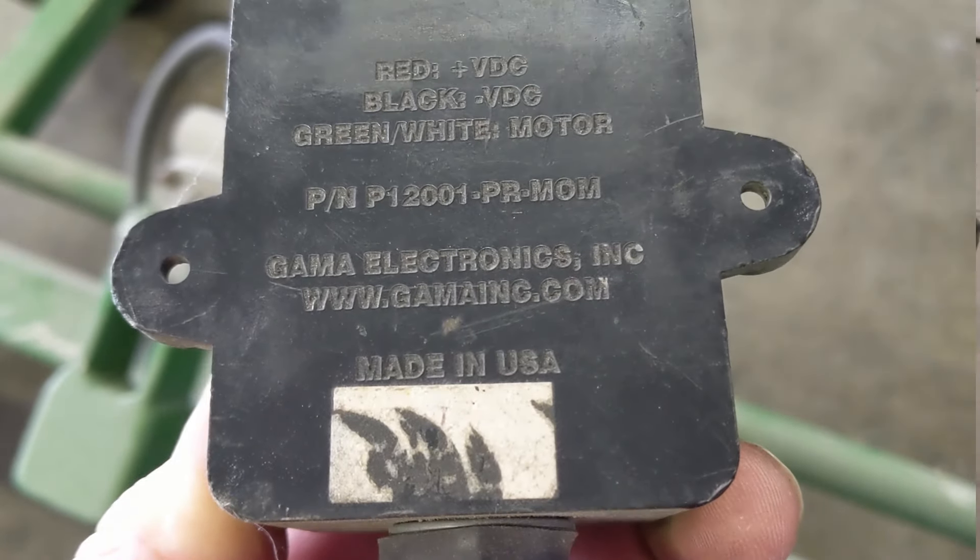The third thing I wanted to say more about was hydraulic versus electric. If your tractor has hydraulics — a loader or remote hydraulics on the front — in my opinion that's the easiest way to use these grader boxes because it's way more responsive and you have more feel in the valve. The electric actuator is a great solution for vehicles without onboard hydraulics, but it's a little slower, and if you want to do a lot of up-and-down grading, hydraulics is the only way to go. The hydraulic cylinder I use has a length of only 13 inches when retracted pin to pin and only a six-inch stroke — it's a small cylinder, about $50 on eBay.